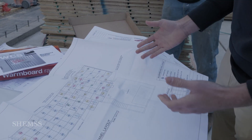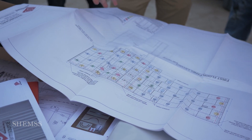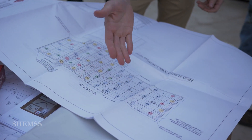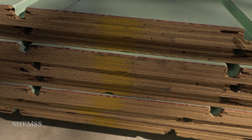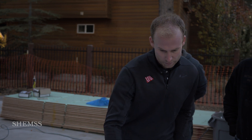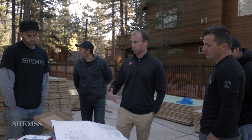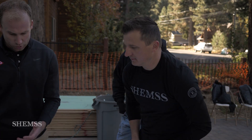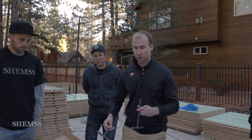Here is an example of the plan set. There is a panel mix based on the joist layouts — you have left panels, straight panels, rights, and doubles — and those are color-coordinated for their different panel orientations so you know exactly which panel goes where. There are also diagrams showing how to modify panels on site, but in most cases they are just full sheets installed directly over the joists as traditional plywood would be.